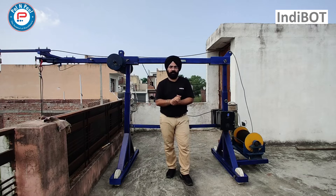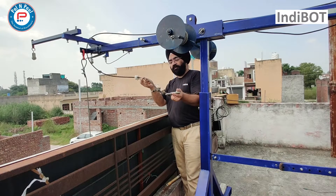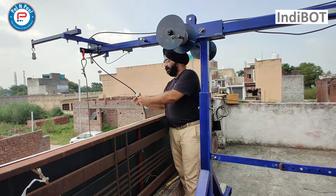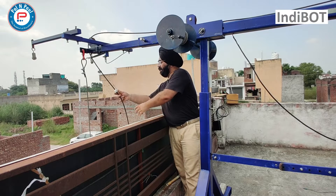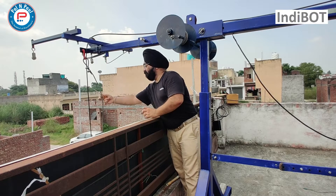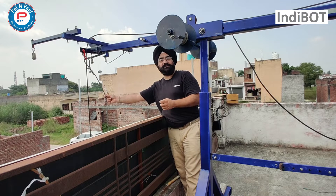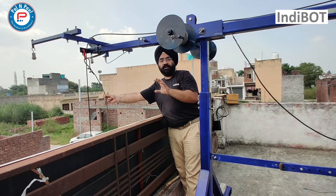This is the main wire — the main steel rope — with hooks. With this hook we mount the cleaning unit. This is the adjustment nut, which is adjusted to get your equipment to automatically stop. This is the sensor. This is the safety wire, which is the anti-falling system — so in case the main wire fails, your cleaning unit will hang on this wire and will not drop.